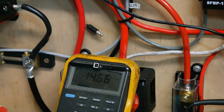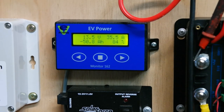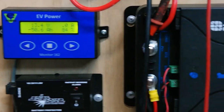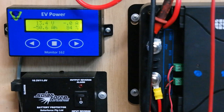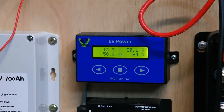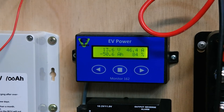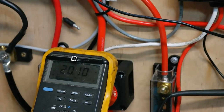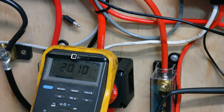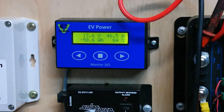Disconnecting and reconnecting the solar: at 15.6 volts open circuit it represents a fairly overcast day, dropping to 14.5 as it starts. The MPPT — maximum power point tracking — is working hard. We're getting 33 to 34 amps out. Setting the voltage to around 21 volts, which you'd expect from your panels, we now get 37, 39, 42, 44, 46 amps. The MPPT has moved the operating point to 20 volts for maximum conversion of the available power.